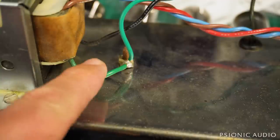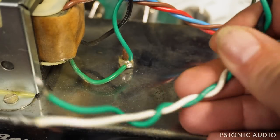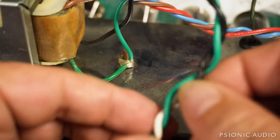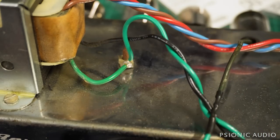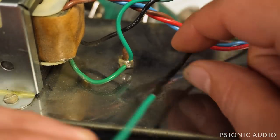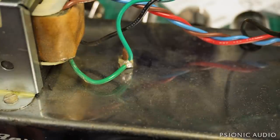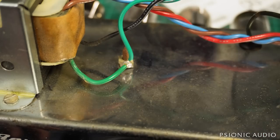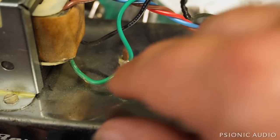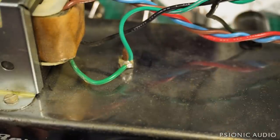Along those same lines, they've got this one secondary of the transformer going here to ground, and the other one is just floating in space. This white one is spliced to the black one — black and green that turned into white and green. All that's nonsense. And then there's this spliced wire here which is the negative feedback connection. So I'm going to replace the whole thing with a little terminal strip that lets me mount the secondaries directly to the strip, the negative feedback wire directed to the strip, and then run separate wires from that terminal strip to the speaker — so it's not the output transformer secondaries themselves that will be strained. It's an easy fix.